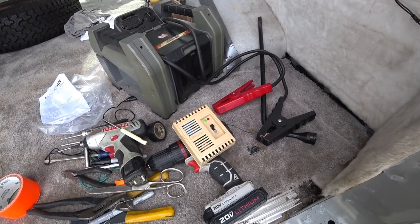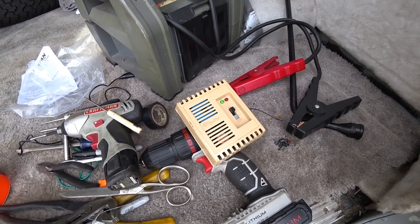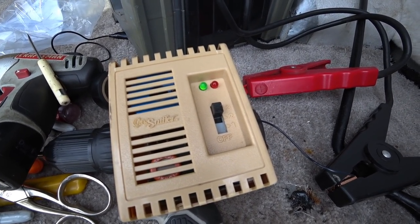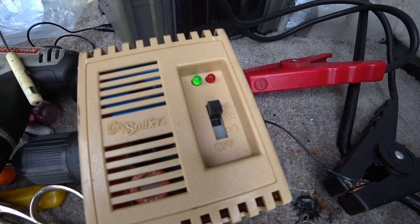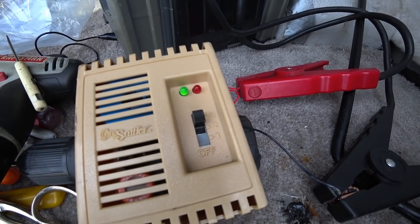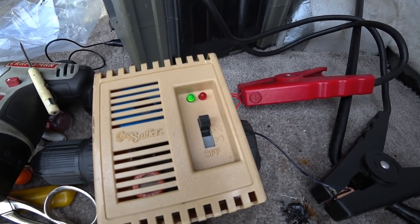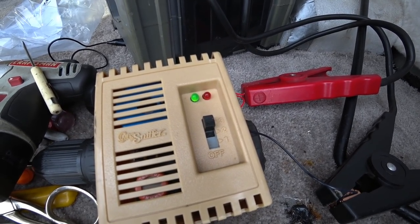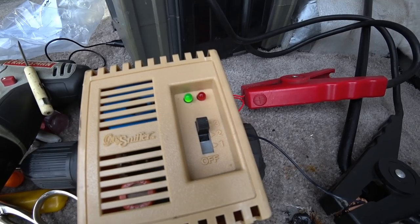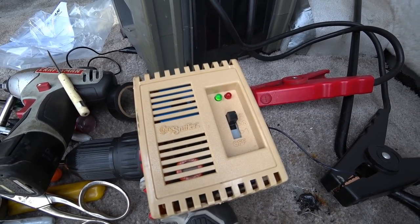Before I go in, I wanted to check this out — this is original from the 80s, a gas sniffer that detects propane. Position one on the switch is off. Position two is for the beeper to not sound. Whenever you turn it to position three, it's sensing gas. When you first turn it to three, the beeper goes off — what you do is move the selector to position two for about 15 to 20 seconds, which allows the system to warm up, then move it back to three. Right now it's in the sensing section, waiting to detect liquid propane gas. It's just a propane gas sniffer — not carbon monoxide.